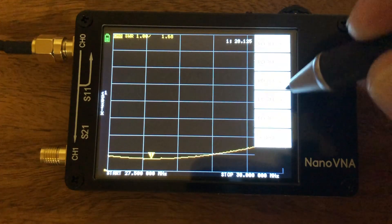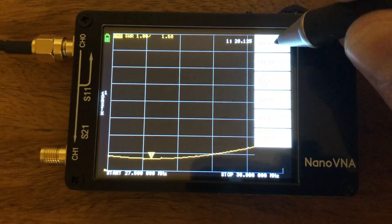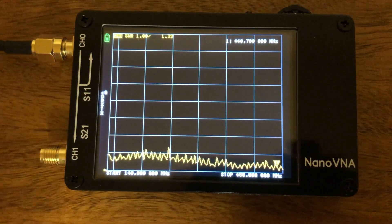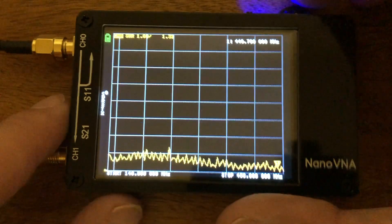So we're going to see how well this antenna resonates on 2-meter and 70-centimeter. I'm going to recall - I put this one on recall zero. You can see at the bottom left I started the sweep from 140 megahertz, and on the right I have it going to 450 megahertz. Right there on the right where we have the little downward arrow, we're at 1.32 SWR. So the UHF element is working phenomenally well. And then we can just scroll to the left.